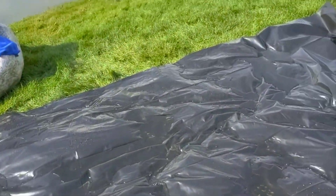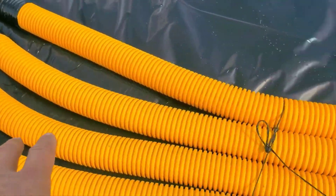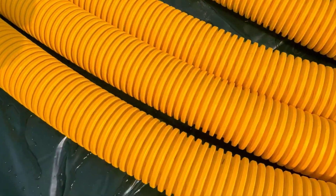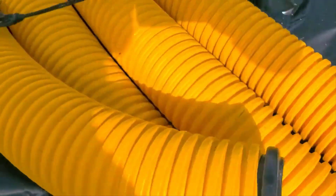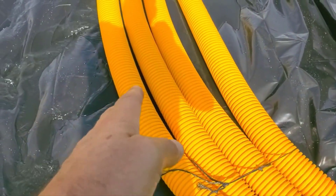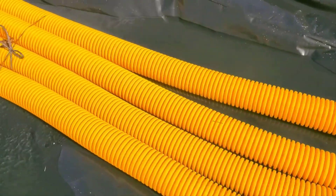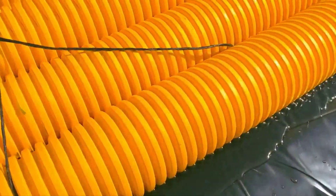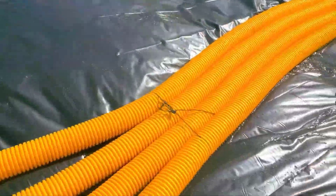We're feeding out of a lake, so all four pipes are loading up with water and the water is running out of the pipe throughout. The water makes it all the way to the end — we've got end plugs in, as you can see. Throughout the entire leach field, knife cut allows the water to be dispersed over a larger area. This is so you don't get your lawnmower stuck. Unlike the eight-slot staggered, with knife cut it's just a drip the whole length of it.